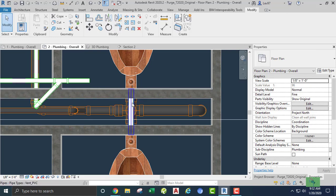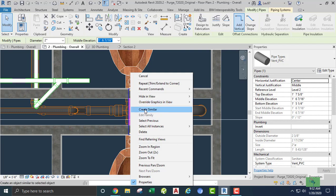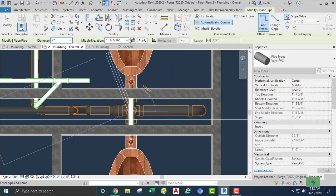It's good. Do the same thing that we did with the other back-to-back plumbing fixtures, which was our lavatory, and that's the midpoint of the 2-inch, right? So we choose that, and we are going to go up, because it's going to be a riser. Let's go up 20 feet, okay? We go back down to make sure that's right. So now we apply to that current offset, right?